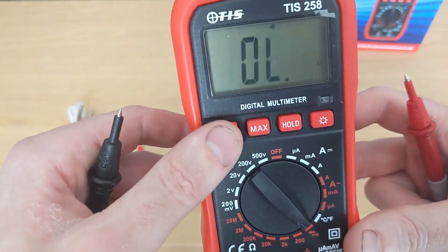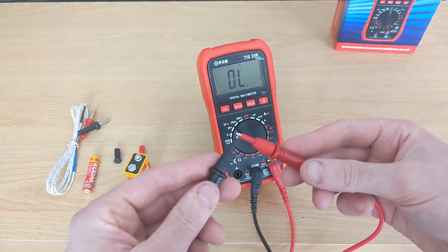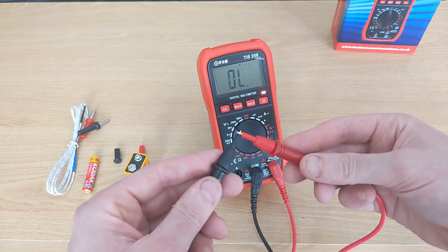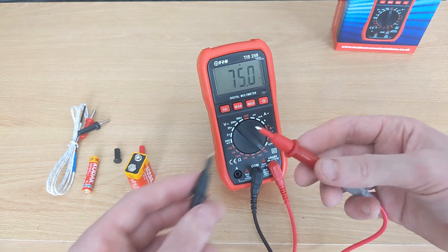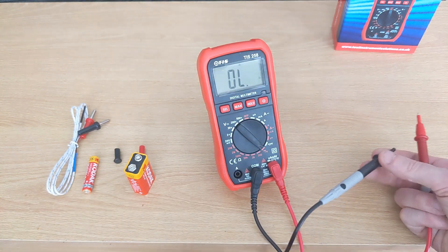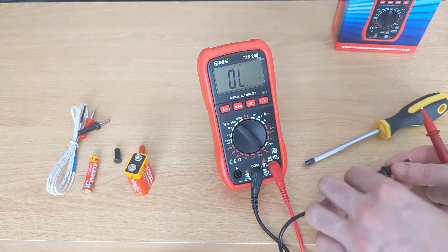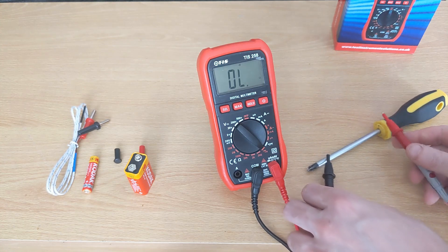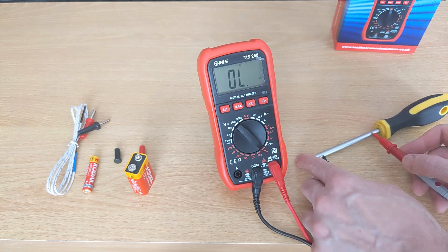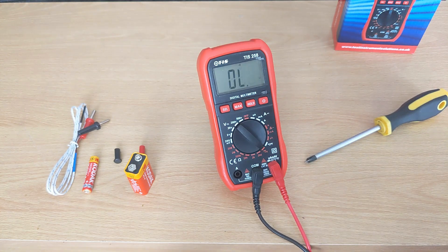Let's try continuity. You've got to change it to continuity mode with one of the buttons. And there we go — that's what I've wanted for a while: a multimeter that will do a buzzer tone as soon as you complete the circuit. That's pretty useful because I'm sometimes fixing circuit boards, and it's good for testing traces. Sometimes I pick up old computers with battery damage and it's a great way of testing the traces. You can see it's working with this screwdriver.